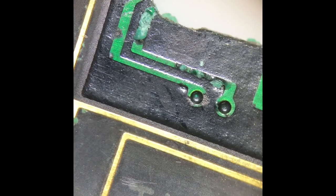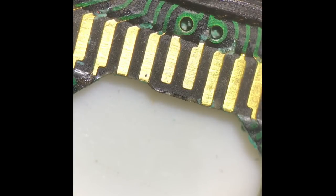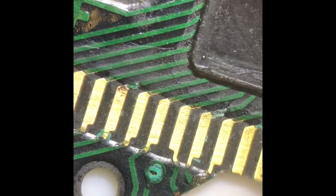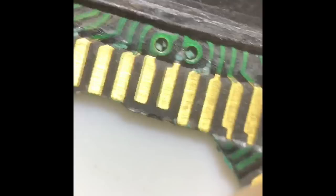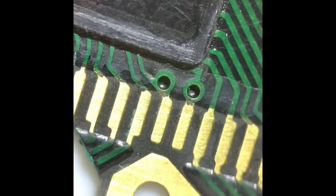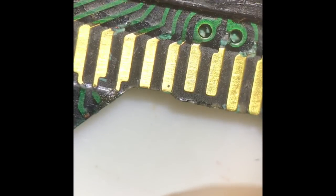So we'll clean that now using the same method as we did before, and I'll put it back on the microscope and we'll have a look. Okay, so I've just cleaned all those contacts with the alcohol and the fibre brush again, and as you can see, they look a lot better. The bit that I thought may have worn off the gold was erroneous. That was actually just dirt. The tracks look okay to me, but